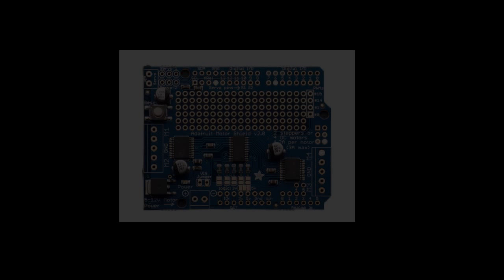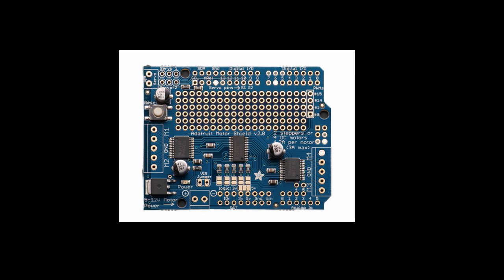This is an image of the motor shield card. It isn't fully populated with all the connectors but we'll use it to orient ourselves. You may recall in the previous video we talked about how these two holes down here — populated with a little two-lead connector — are the holes we'll use to power the motors controlled by the motor shield, with the positive lead on the left and ground on the right. These leads connect to the three 1.5V batteries in the battery compartment of the car. On the left you'll see the connectors for the DC motors that the motor shield will drive, and we'll talk about how to connect those a little bit later.